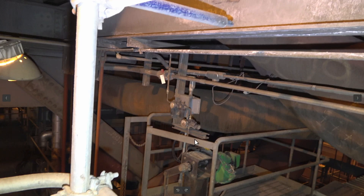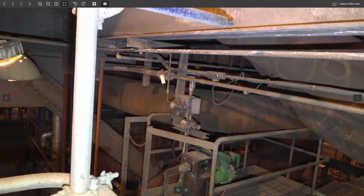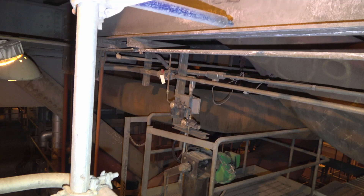This is the air box — this would be the cold air line coming into the mix box. We have a K-drive controller on the damper. You have the cold side and the hot side coming in. The temperature up here is controlled with the temperature probe on top of the pulverizer. You want to maintain about 140 degrees or so going to the burners. The air coming in here can be very, very hot depending on how wet the coal is — if you get ice and snow with it, it could be almost all hot air.